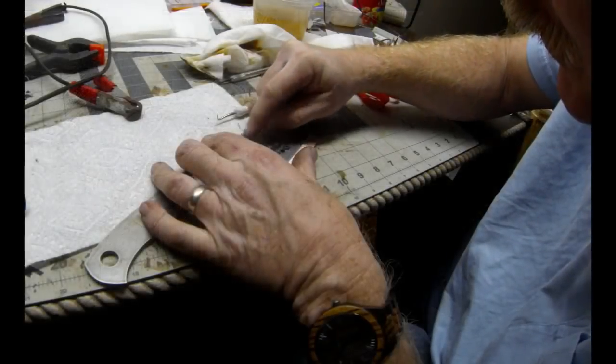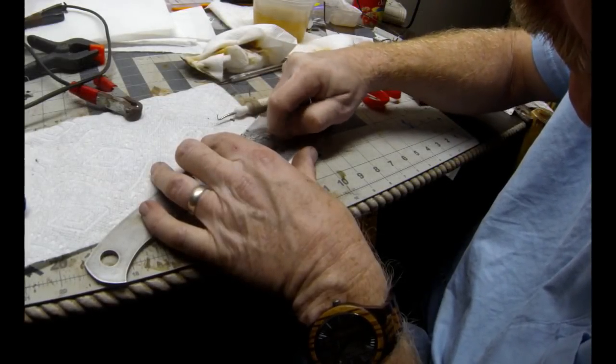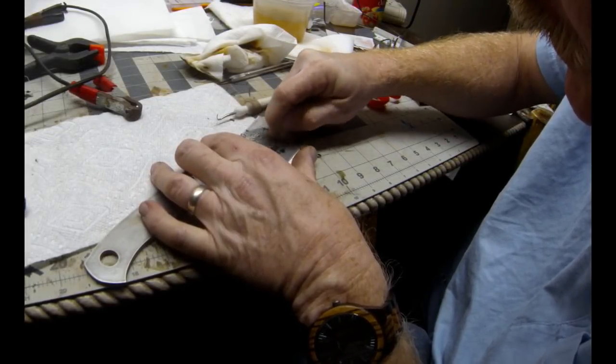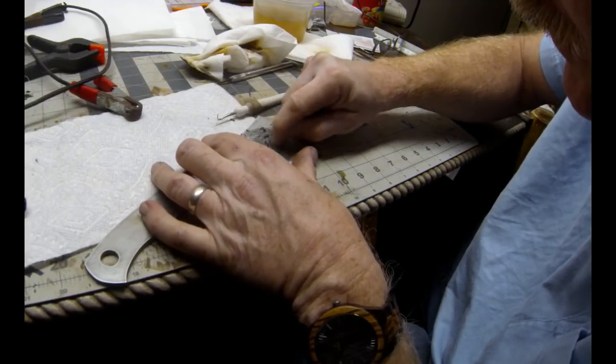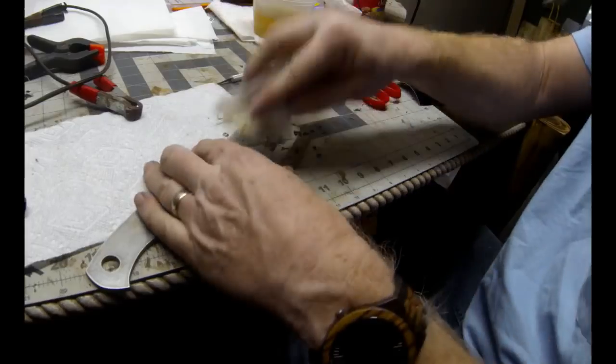You could go a little bit more than that if you wanted additional depth, but for etchings done prior to heat treating I really like it to be deep enough so that it stands up, because you are going to have to polish off all the carbonization after heat treating.